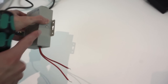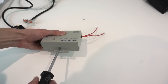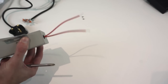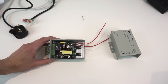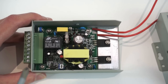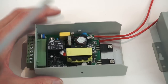There are little tabs to wall mount it and a screw on each side. What we're trying to do here is replace these individual single insulated wires for the mains input with a proper piece of double insulated mains flex, and also earth this. The wires just pull through the grommet. Inside it looks like a nicely built little device - doesn't look bad quality at all. It's just that mains input cable that's really rubbish. There's your relay, and what I want to do is find a way to replace these two wires with a bit of flex and connect an earth.